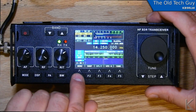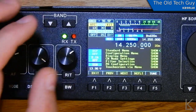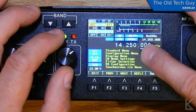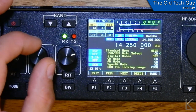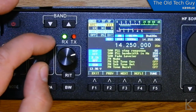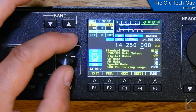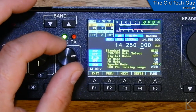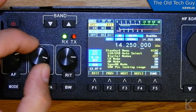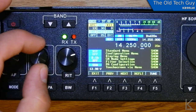The menu system: when you're in the menu, these two knobs control it. The menus are all hidden by default — one knob will reveal a menu and the other lets you move through it, and then you can change something in the menu using that knob. So I turned off sync AM — synchronous AM mode — and turned it back on, then hid that menu and moved on to the other menus.